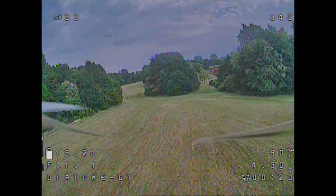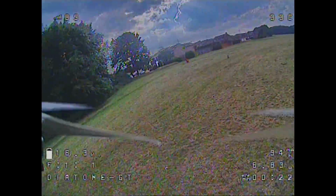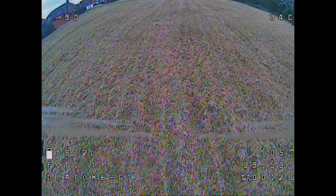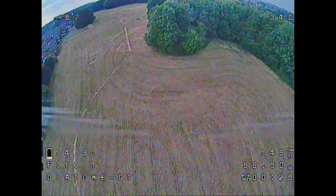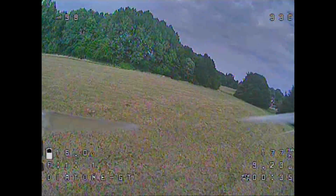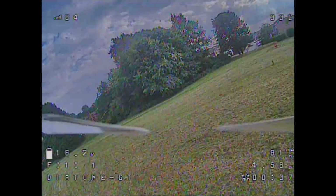But what about a 1300 mAh battery? I've said this before, but using smaller batteries to get the weight down doesn't necessarily increase the performance. In fact, a lot of the time you get a decrease in performance, and that's because the amount of amps a battery can provide is tied in with its capacity or size.